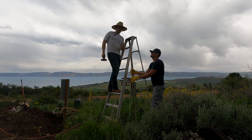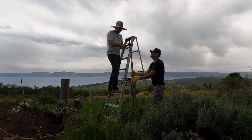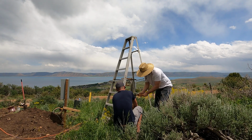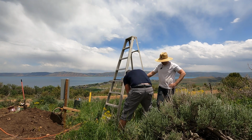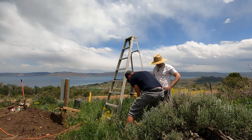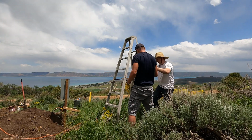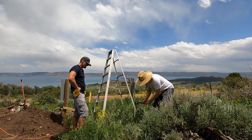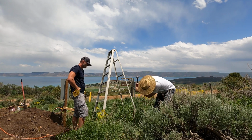Heavy, you lose power on the swing. What we're doing here, in case you don't know, is installing ground rods. Code requires that we have less than 25 ohms of resistance so that if there is a ground fault current or lightning strike, electricity has a really easy escape route. This prevents fires and heat from building up in the wires. So definitely an important safety feature.